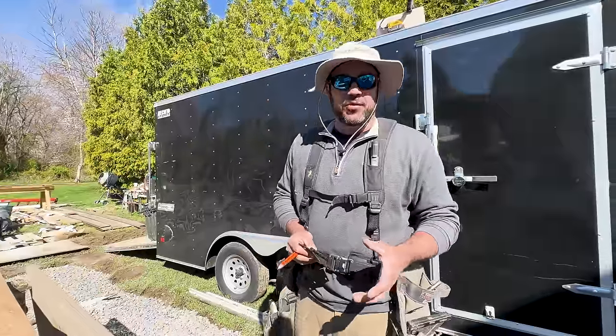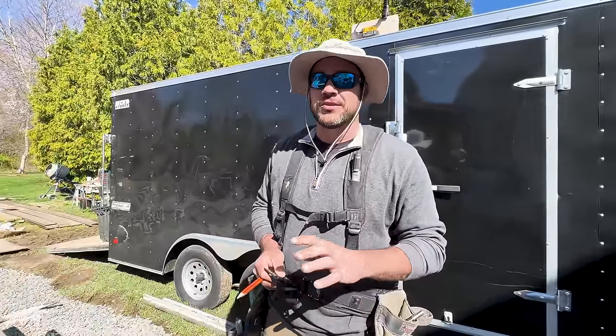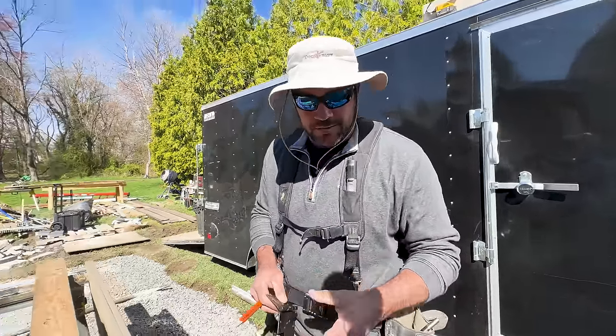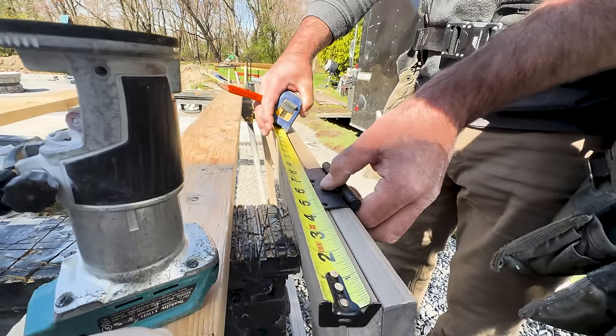So now that we have the door assembled, the next step is going to be the hinges. What makes this a little bit easier is I can determine where I set my hinges, so I don't have to worry about math too much. So the first thing I'll do is I'll set my top hinge at 5 inches off the door.